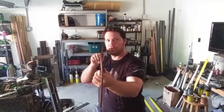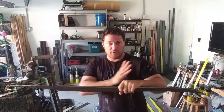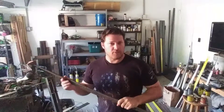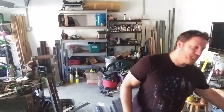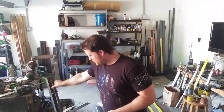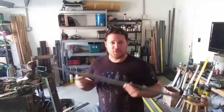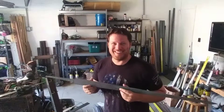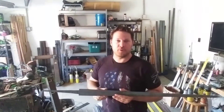I don't know if you can see that there — the camera's picking it up. This blade, because the warp is in the plane of the blade, I can fix it, but it's not preferred. We want to figure out how to heat treat the blades without having them warp like crazy. Anytime you have a very long piece of steel that's relatively thin to its length, it's going to warp in heat treat and there's nothing you can do about it. So how do you fix it, or how do you correct for it?